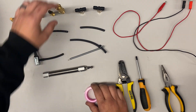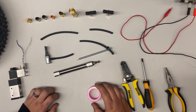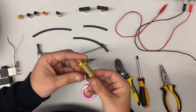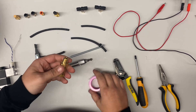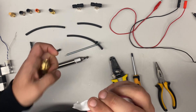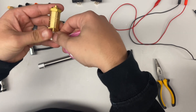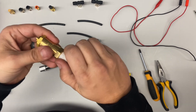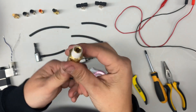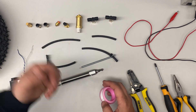Next, we're going to apply Teflon tape to all of our threads. You'll need that to make an airtight seal when you attach everything to your pneumatic system. We'll start with our pressure release valve — this will release pressure so you can only go up to 50 PSI, making sure everybody starts at the same level playing field. You're going to want the threads facing towards you and go clockwise. Put a little pressure there, attach it, hold it down, wrap it around one full rotation, tighten the point, then break it with your fingers. As you thread this, it tightens around those threads rather than unraveling. You'll do that for each set of male threaded NPT fittings.